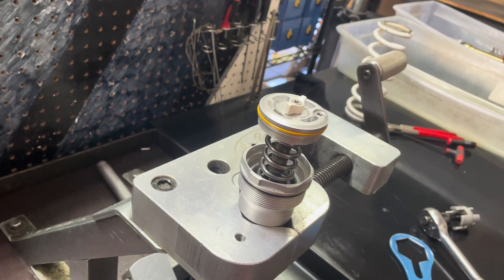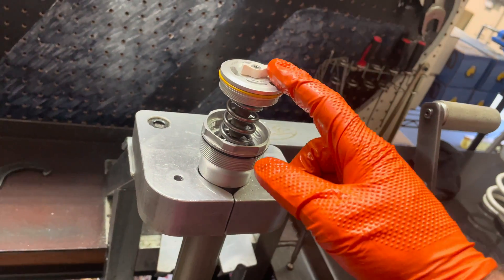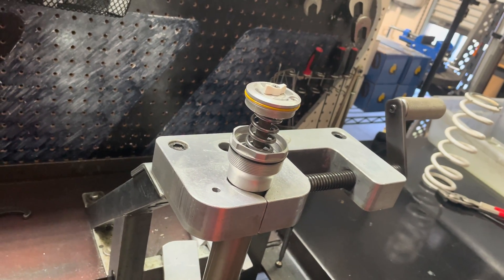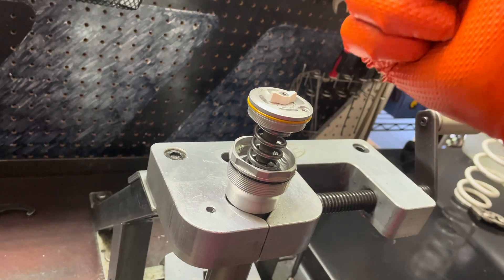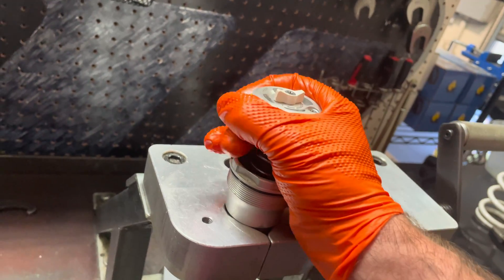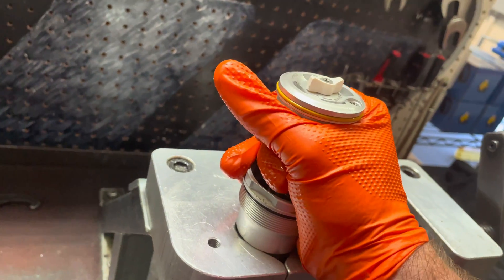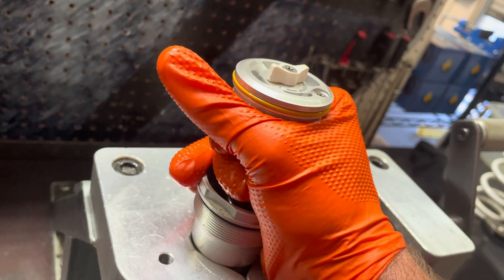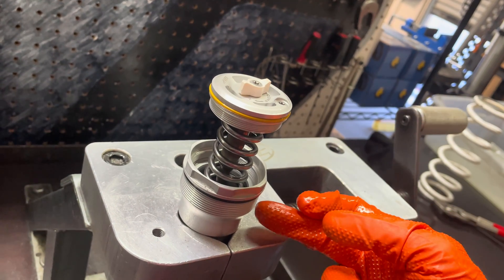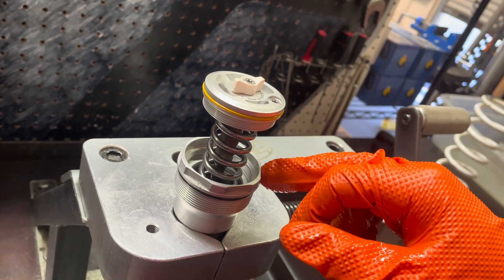Now, another reason not to clamp this too tight is if you do have this clamped too tight it's going to be really hard to pull this out. As we pull this out we're creating a vacuum underneath, so it wants to suck this back in. Take your time, kind of wiggle it back and forth and pull up, stop for a second, let the pressure equalize, and then go back and forth and pull up a little more. The reason you want to do this slow is you don't want to yank it out really fast and damage one of the o-rings or piston bands that is located on this compression assembly, because you'll drag it against one of the threads or sharp inner corners.